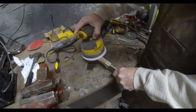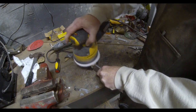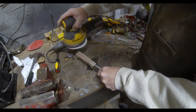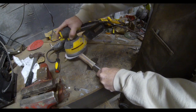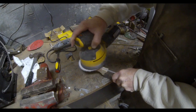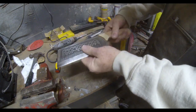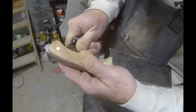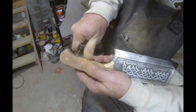On this particular knife I also wanted to add a design onto the spine, so I wanted to polish the handle and spine down to a 220 — starting at 80 grit and then going to 220. I'm going to etch the spine after the handles have been mounted, and I did that on purpose: if you do it the other way, any grinding or mishap while finishing the scales is going to mar the surface of the etched spine. So I finished the scales and handles first, then I'll apply my vinyl sticker to the spine, cover the surrounding areas, and do the etching. Before that, I added a little detail onto the handle with a Dremel grinder and a very small round bit — just adding a little texture, a little dimpling.